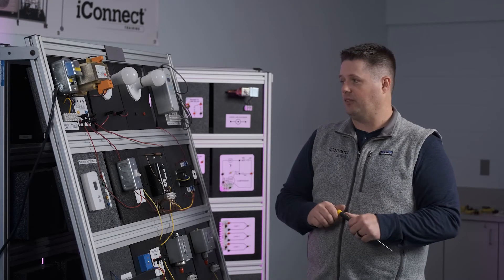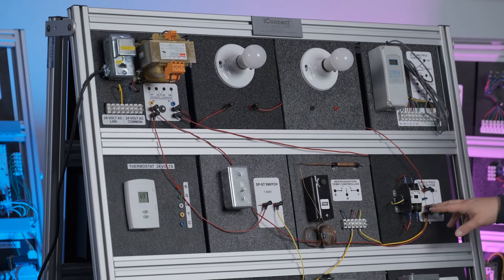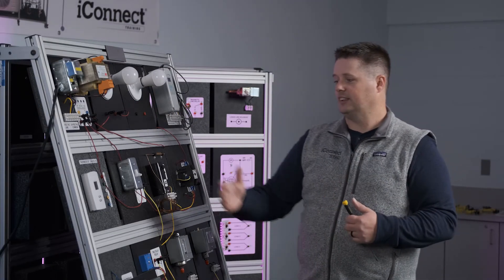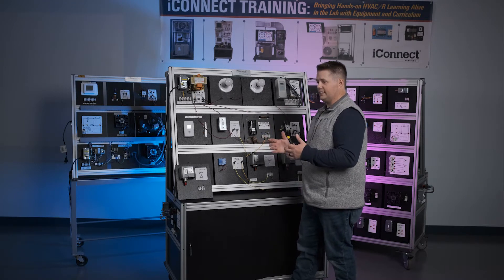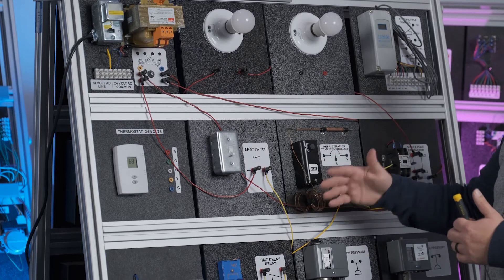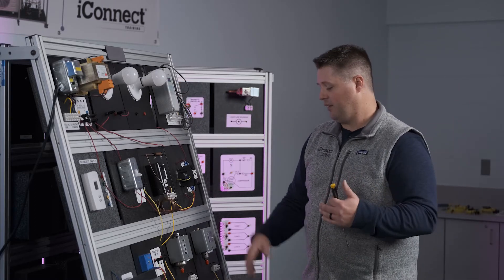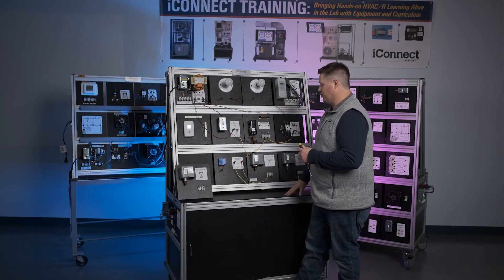I have a second circuit run on this, so it's a two-part circuit. A second power supply goes through the open contacts on the contactor, which then powers the light bulb. This is a control and load circuit combined into one. The first set is your control circuit, simulating equipment in the field with multiple safeties that make or break the circuit, allowing the contactor to carry load voltage to the light bulb, turning it off in the event of a high or low pressure event. The time delay prevents short cycling.